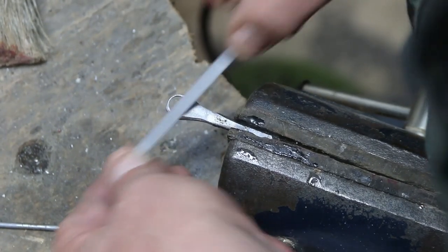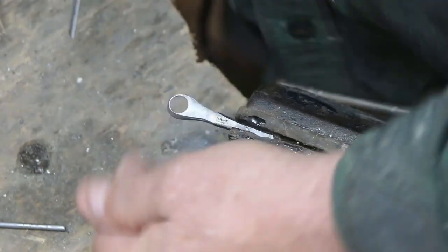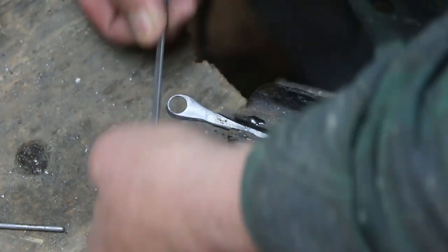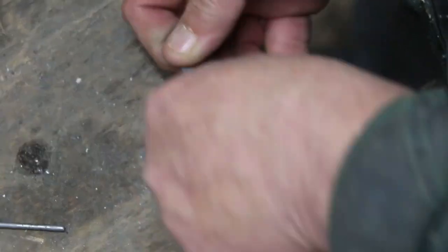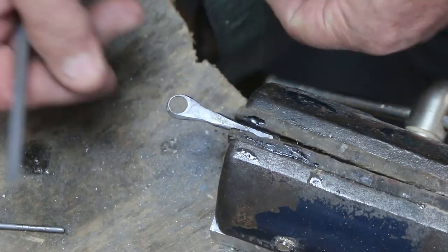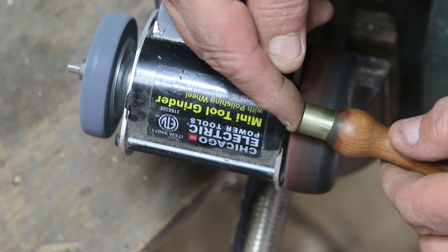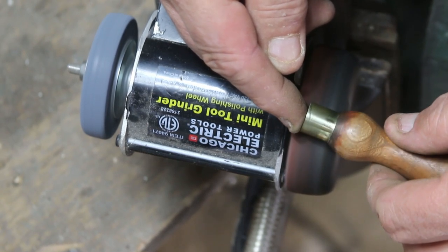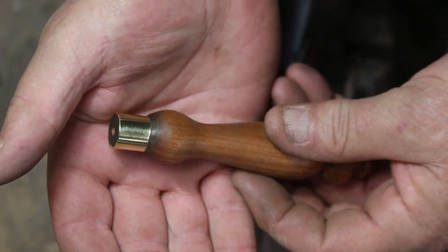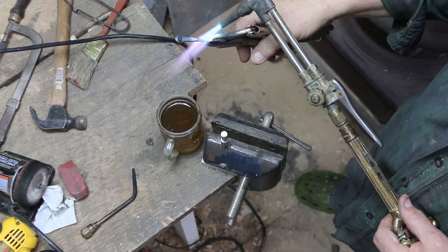It's going to go in about two and a half inches. Grab some Swiss needle files to get the shape — the steel is not hardened yet so you can go ahead and file it. After you harden it, these files won't work anymore; you have to go to grits, sanding, and grinding. It's a prototype so I'm not trying to make it too pretty. Filing time on this was probably 15 or 20 minutes in real time. Needs a ferrule on the end — cut off a piece of brass tubing, press fit it on there, did a little file work and made it smooth going into the handle, then buffing for the final finish.